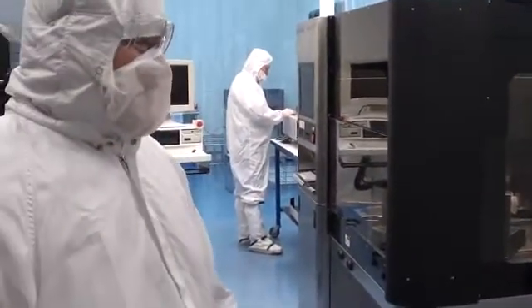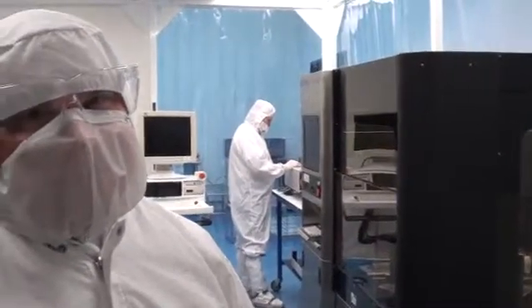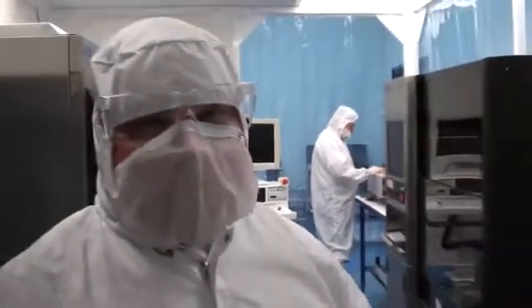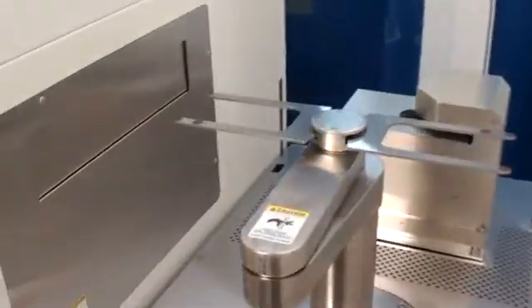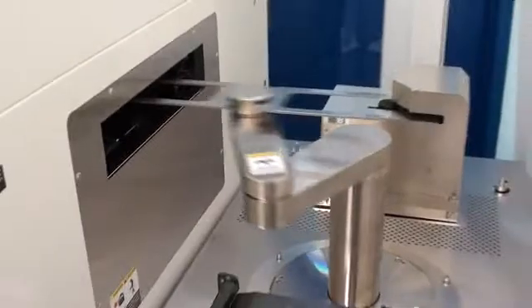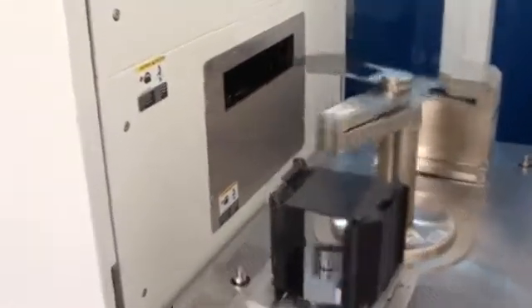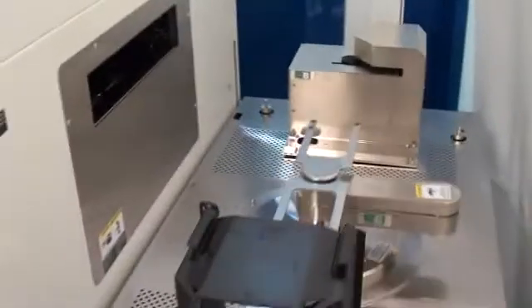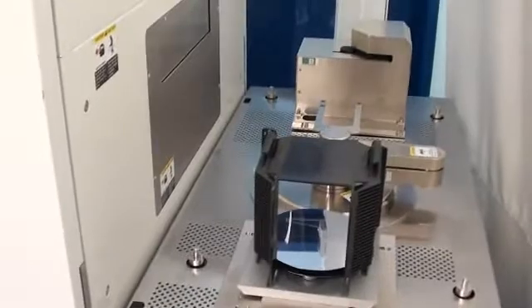On this system, we replaced the laser with a brand new laser. We replaced both PMT tubes and did a full calibration at the 8-inch. Now it's just undergone a 6-inch conversion, so I'm just cycling some wafers to ensure that all my teach positions are correct and that it runs 6-inch without any errors. We've modified and upgraded the AIT-2 to run 6-inch wafers — that's specifically what our customer has requested. We've installed a 6-inch chuck and set up the tool to run 150-millimeter wafers.